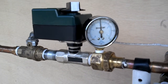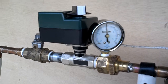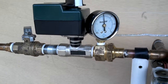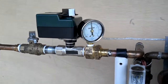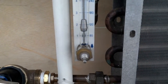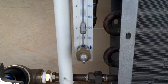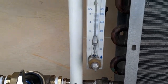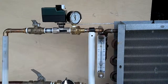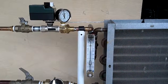That's what happens in air conditioning and heating systems when you have a really good temperature control valve, but it's matched with a manual balancing valve. Whenever there's variations in incoming pressure, you're going to get variations in the flow. And we all know that creates inefficiencies, because in this business, stability is efficiency. The more stable you can hold the flows, the better.